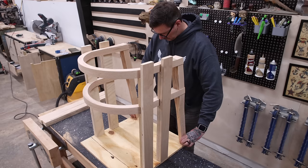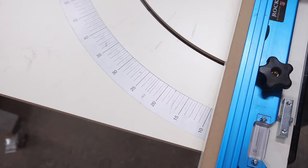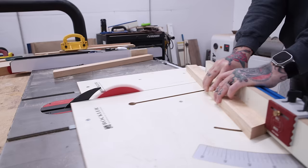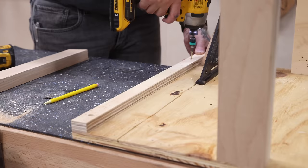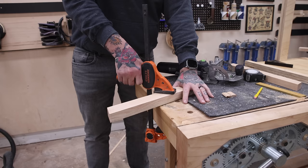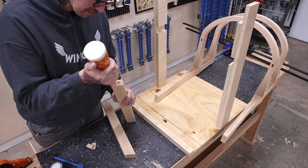In order to get the legs cut accurately, I have to put the whole thing back into the fixturing jig to reference the angle and placement of the back legs. When I drew this up in my modeling software, I set those legs to 20 degrees, and in this case 20 degrees looks good. The angle doesn't have to be perfectly precise — I could end up at 19.5 degrees — but the important thing is that once I set my crosscut sled to that angle, I must leave it there to cut all the complementary angles. My strategy is to add dominoes to align the legs into the base of the seat, then use the fixturing jig itself to clamp everything in place.